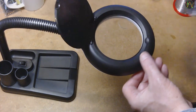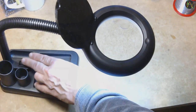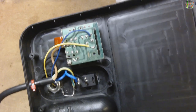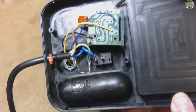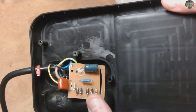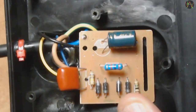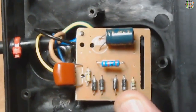I bought it some time ago for tricky soldering jobs because it has a dust-protected magnifying glass claimed to be x5, and a string of 40 LEDs to illuminate the work area. The mains cord is my replacement because the original one and the molded unfused UK plug were both criminally unsafe. Anyway, the point here is the power supply, which is unsurprisingly a textbook capacitor dropper. You can see the orange capacitor 0.22μF with a discharge resistor across, a discrete full-bridge rectifier made of four diodes, two current limiting resistors, and a green 4.7μF smoothing capacitor.